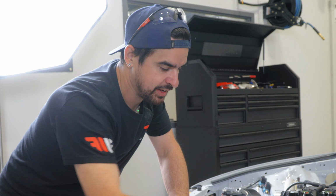Because we use the HD alignment tools during the whole process, you can see with the HD alignment tool on there, the coupler together that holds the upper and lower cold side pipe together, we have a nice, perfect 1/8 gap between the HD flanges. And that's what we want to have, to allow this tube to have movement and flexibility while the car's driving and making passes. If you use the clamp to help line up the union sleeve, it'll make your life a lot easier. Hear that nice snap together.